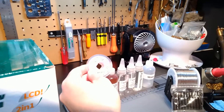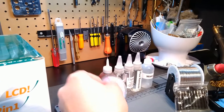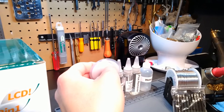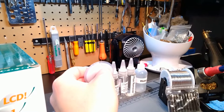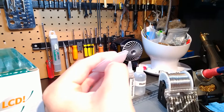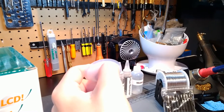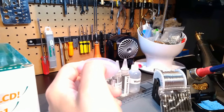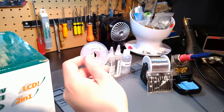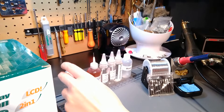Another accessory that I feel no soldering station is ever complete with — especially if you're doing rework — is the desoldering braid. For those of you not familiar with it, if you make a mess in the sense that you apply too much solder to your joint, or if you're doing rework and that blob looks huge, this braided copper is saturated in RMA flux. You simply contact this with the actual blob of solder you want to remove and heat it with the iron itself, and it will absorb the excess solder. A very, very well-required necessity when you're working on anything with rework.